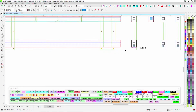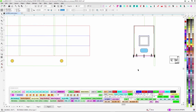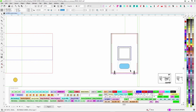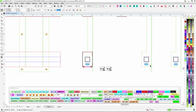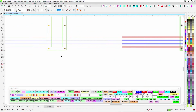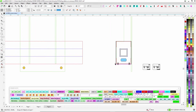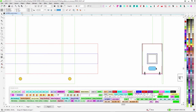So on the bottom here, that will be how you access. So the bottom skin will go long, and we'll just have an access plate panel all the way along the bottom here, screws on the bottom. And then all we really need is just a place to run cable in between. So each of these little verticals here will have just a little hole in them right here that you can just feed through. So you have access doors all the way along the bottom here, but you'll have the access doors in between, and then just feed the cables through. Most all this wiring will be done in the shop. It'll just be the field connections that need to be done. So we just need minimal access for wires.